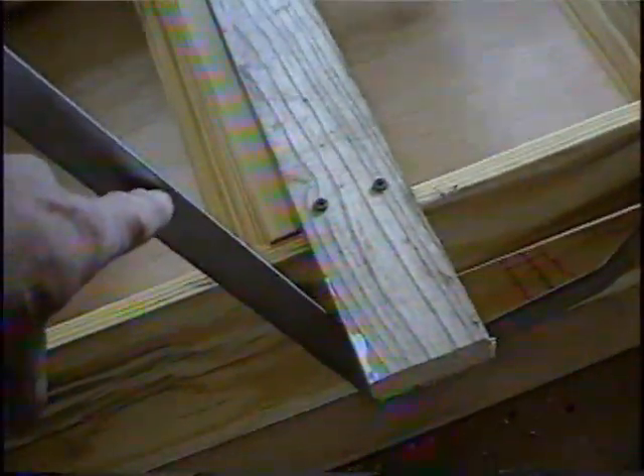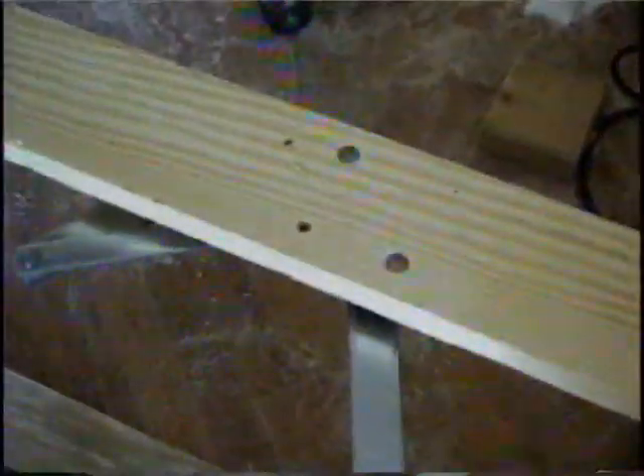What we do is we knuckle our stair over, as you can see. And then I put a block in the middle to keep these arms from flopping over. I do not recommend anybody doing this — I'm just showing you because this is how I do it. But if you were to do it this way, we'll put a support on the ceiling that needs to go right in between this area because this is the balance point of the stairs. So now we'll figure out this area from here to the back part of the end.